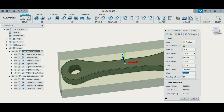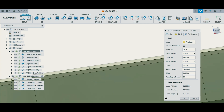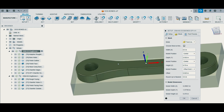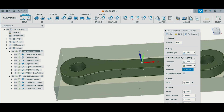I always go fixed size box. The height of the model position on Z — that's usually how I set my parts — is like 25 thousandths or 10 thousandths, so I can take one finish pass with the face mill and the top will be done. I don't have any more roughing or tooling marks from an end mill doing it, just a clean finish pass with the face mill.